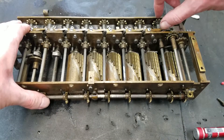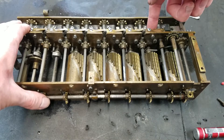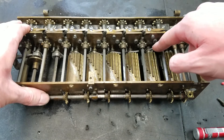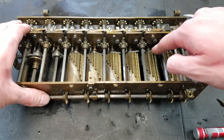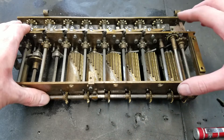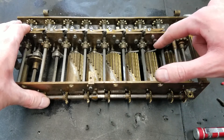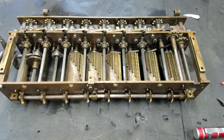You can see that when I push this down, this pushes on the lever which has a pivot down in here, which is attached to a shift fork which pulls this piece forward, such that this peg will align with this gear. In the untripped position, this peg is pushed back so it misses the teeth of this gear and bypasses in this non-toothed section. Then there's a cam on the bottom of that piece, so as it keeps rotating, once it's done with its carry, that cam will ride up on a pin and push this back to the untripped position.